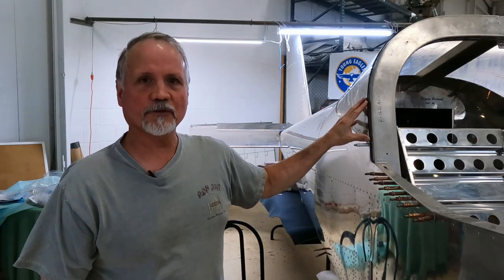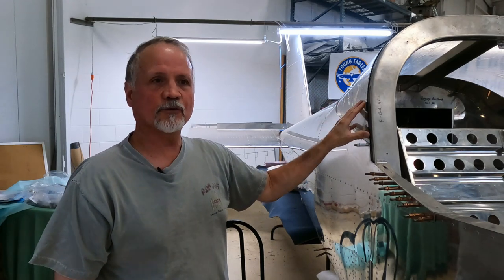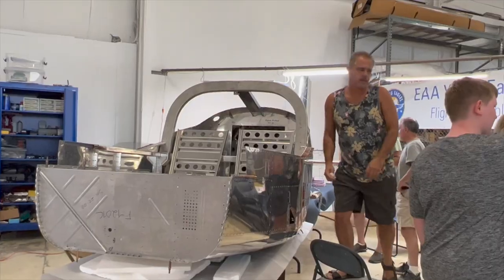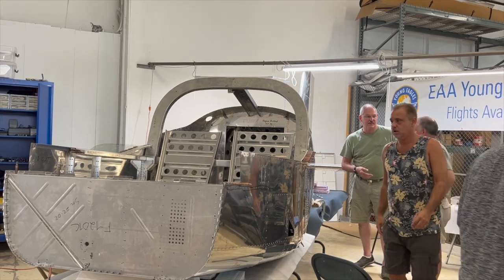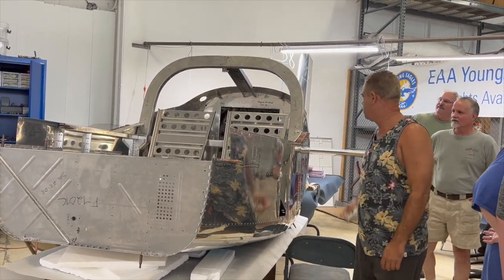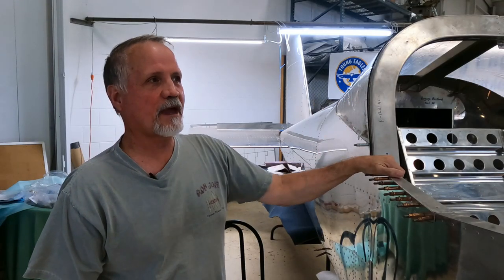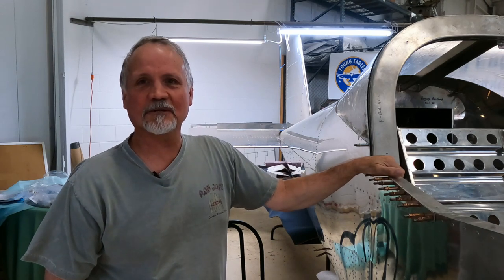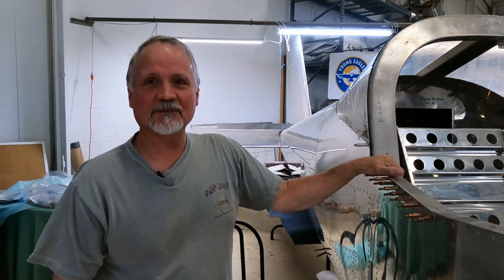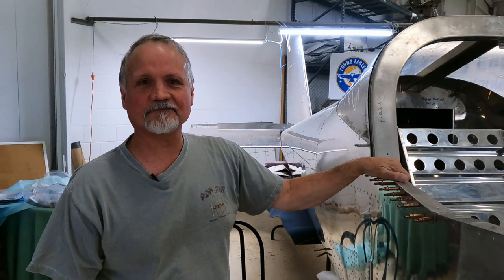There's a lot of drilling through the plexiglass that you have to do, and when you're drilling plexiglass, you want to make sure you're doing it in warm weather. One of the benefits of doing this work in the middle of summer in an unair-conditioned hangar is that we had no problem with the temperature being right. In fact, as we were doing most of the install and drilling, we happened to have some of the warmest weather of the year, and our temperatures in the hangar were in the 90s. So it made for perfect weather for drilling through the plexiglass.